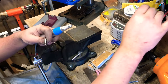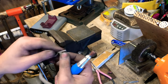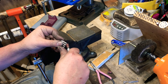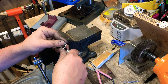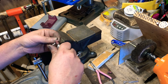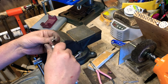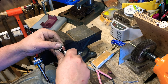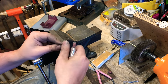So this time I'm going to take my sanding drum again, and we're going to go over the feet. Start at the top and I just go around, just using the tip to take off that hard burr that's on the edge. We want to take any imperfections that were left by the bolt cutters. Most of those should have been gone already, but still have a few left here. Yeah, that looks pretty clean. And we'll go alongside all of them. Just make sure there's no sharp spots.